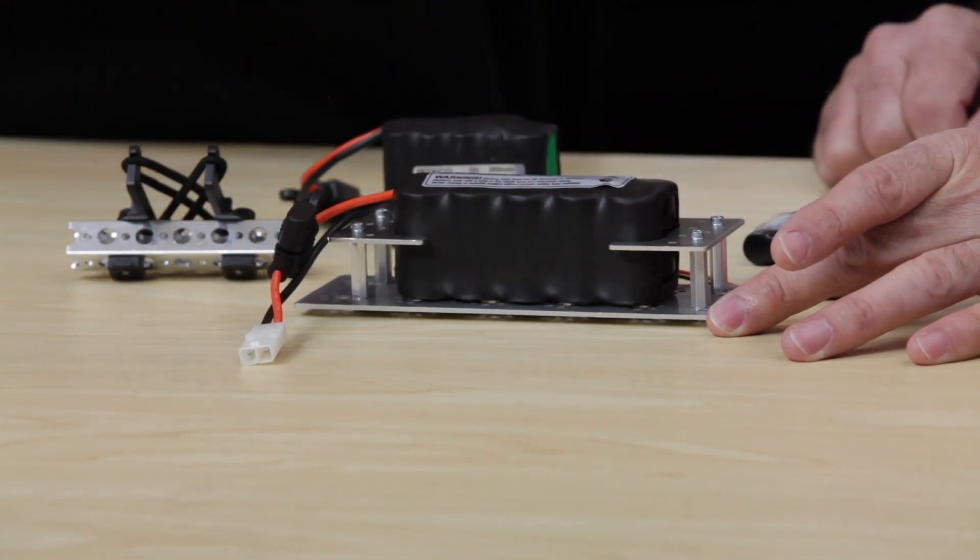We want to make sure we're not putting our battery in a situation where it might fall off the robot during a competition match or classroom activity and possibly get damaged. There are no sharp edges — these are all really smooth with the corners radiused over nicely. It's always a good idea when you pull your batteries out to periodically inspect them — just take a quick look around and make sure the covering is intact, that we haven't accidentally split one or maybe drove a screw through them or something like that. Just always a good idea to do that.